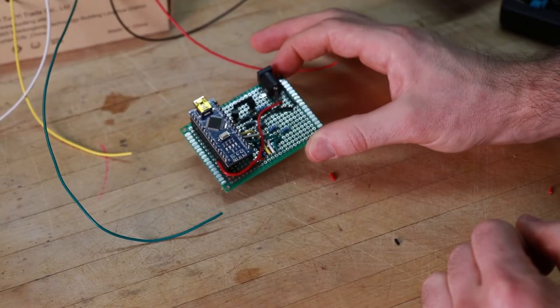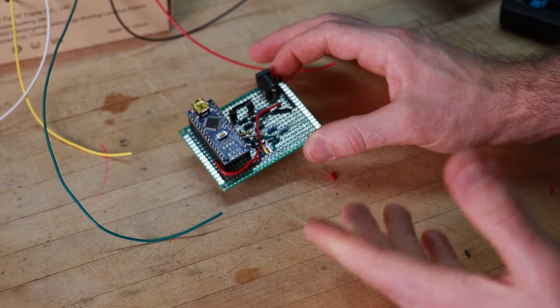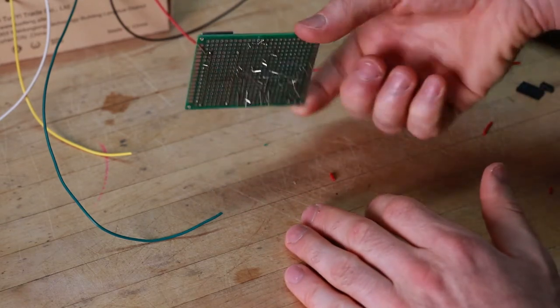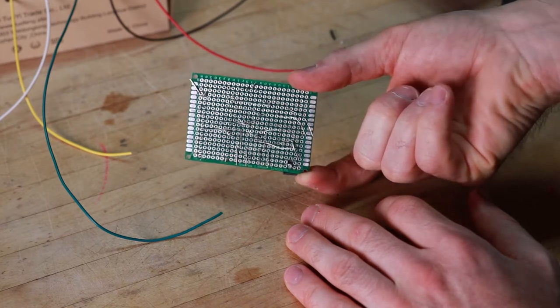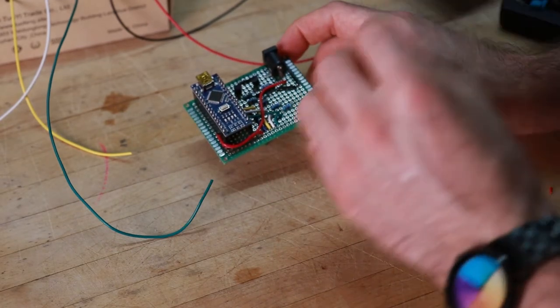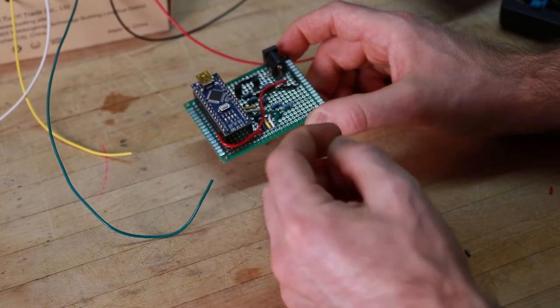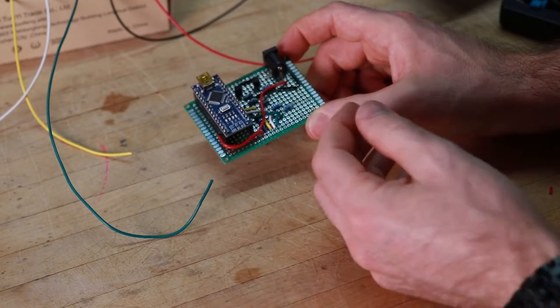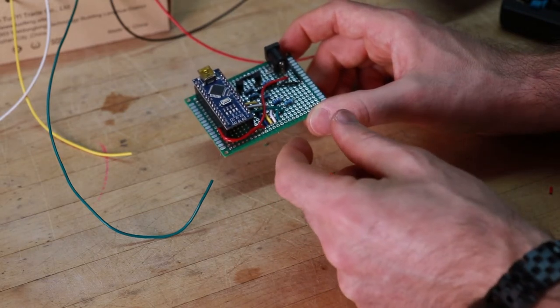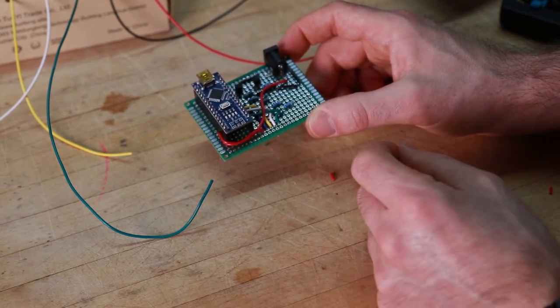There's the power wire run to the Arduino and the buttons. And now really, it's just gonna be a matter of soldering everything correctly on the back, which is gonna be fun. The reason I'm adding the headers for the different boards is I can assemble them board by board and screw them in place and then push the wires together, rather than trying to make sure that one board isn't torquing another as I screw it in place on the case.